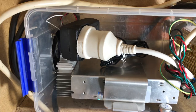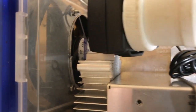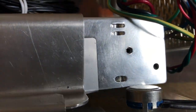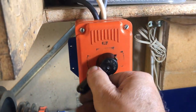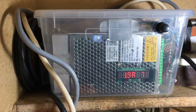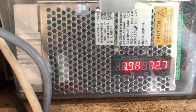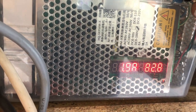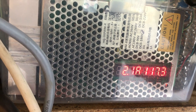When you use the enable connection properly, the device ramps up to full speed over two or three seconds and ramps down over two or three seconds when turned off. Because I bypassed that by switching main power directly, it doesn't work quite as expected. If the display still reads a high voltage and you turn it off then immediately back on, it tries to draw too much current, throws an error, and you have to wait 15 seconds for it to reset. The big orange switch should ideally be connected to the EN enable connectors rather than the main power.